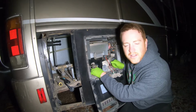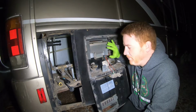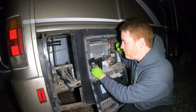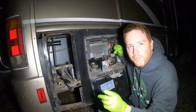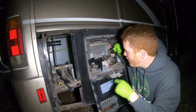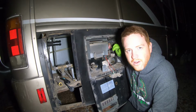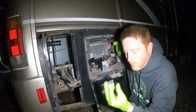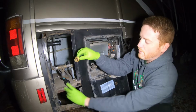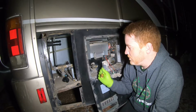It's normally located at the bottom of where your water heater would be. So your water heater is going to be behind your panel, and obviously your drain is going to be at the bottom because you're draining it. So you'll want to back out the anode rod and take it out. Now I can't show you that part because I had the old hot rod in there, and that's what I took out. But it's very obvious. You really can't screw it up. There's only one thing there that looks like it. It's going to be a big nut, or all you'll see is the back side of this, for example, and you'll want to back it out and take it out and drain your water heater.